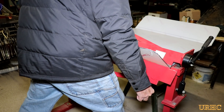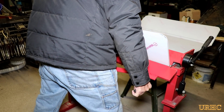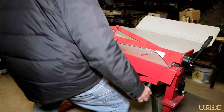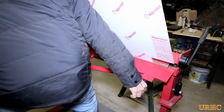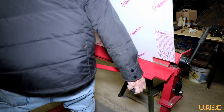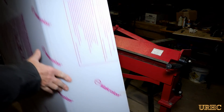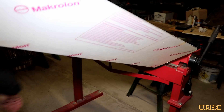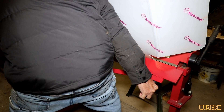With the grooves cut, I put it in the Harbor Freight bender and used all the force I possibly could to bend it. Even with the V-groove cut, this material was harder to bend than a sheet of 16-gauge steel — really tough. I wanted to bend it to about 40 degrees, so I bent one side then flipped it around and did the other. I had to flip it back the other way around because it didn't bend evenly all the way across. That got everything nice, straight, and square on both bends. The bottom stiffening bend across 28 inches was also a tough fight.